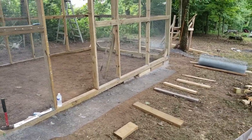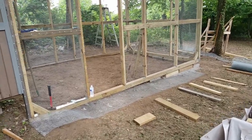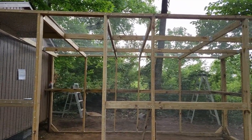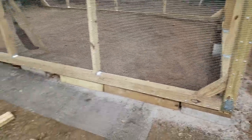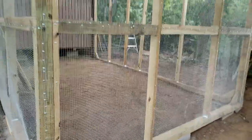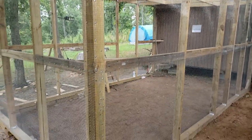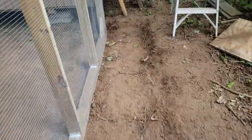Where we left off yesterday, and early this morning I'm up. I finally got all of the hardware cloth put on the run — I'll walk around and show you. Got to put my door up. These chickens just started to lay — the first chicken laid an egg yesterday after 18 weeks! I bought two rolls of 48 by 100 and I haven't used even half of one. But I've still got an apron to do; that apron is going to go on this side. Got all this done yesterday using those lath screws — works out really well. I had to use 3/4 inch since I didn't have a crown stapler. Finished the last piece last night about 7:30.